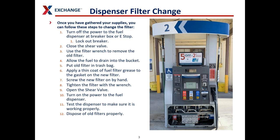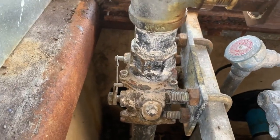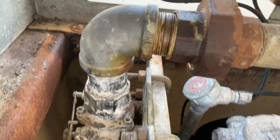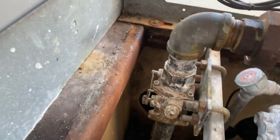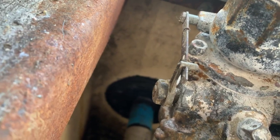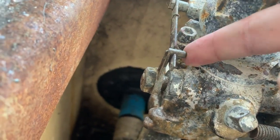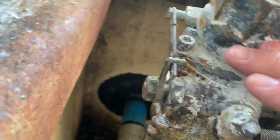I have accidentally left the shear valve closed on a site I was working on. The shear valves should be anchored to the concrete so they don't move — customers will not pay attention to you sitting there. If you ever have an incident and need to shut off fuel, right here is the easiest way to do it. You just reach in, pop that piece up, and the whole thing will shut off. There's a butterfly valve in there that shuts off the flow of fuel so nothing goes up into further parts of the dispenser.